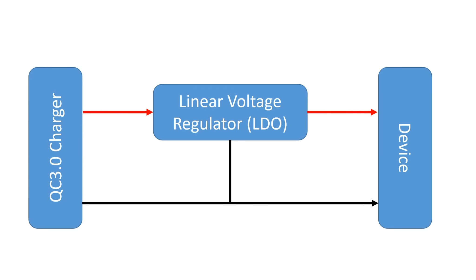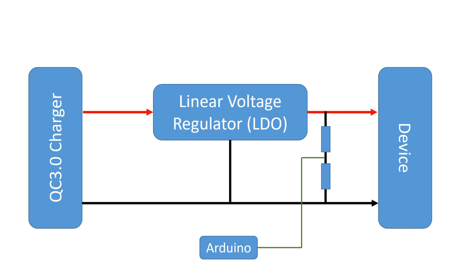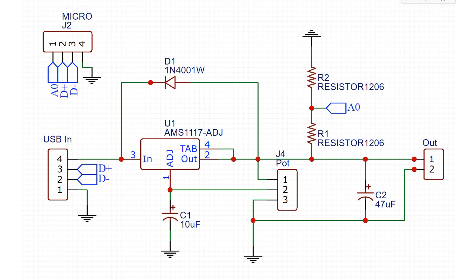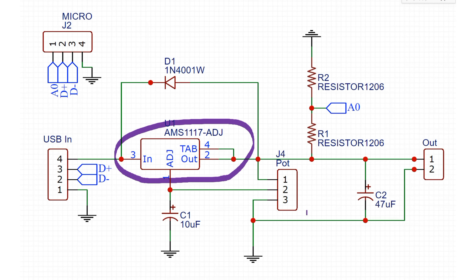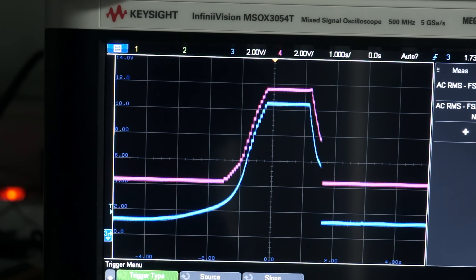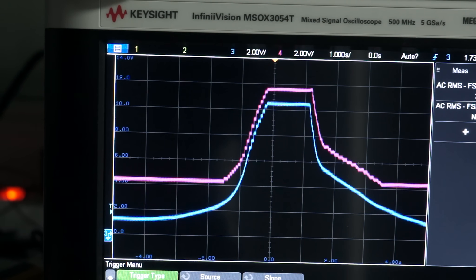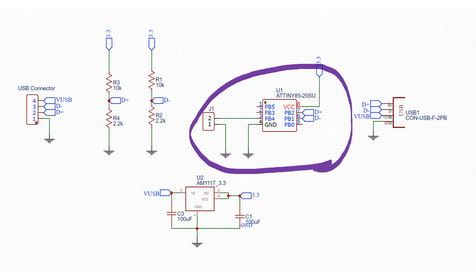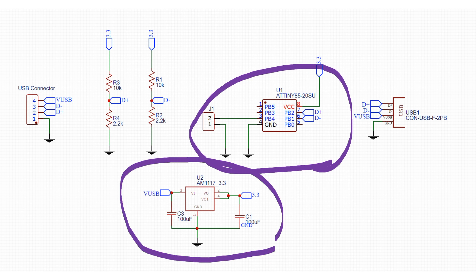Cool. Of course, in addition to the LDO, we need a small sketch which measures the output voltage and changes the QC voltage accordingly. You could even measure the input voltage and adjust the charger even more precisely. I used an SMD version of the AMS1117 in standard configuration. The output voltage is adjusted with a potentiometer. The Arduino measures the output voltage with a voltage divider. As soon as the difference between the QC voltage and the output voltage is less than 2V, the sketch adjusts it. We do not even need an Arduino — we could also use an ATtiny for that purpose, though then you need an additional small 3.3V regulator to power the ATtiny.